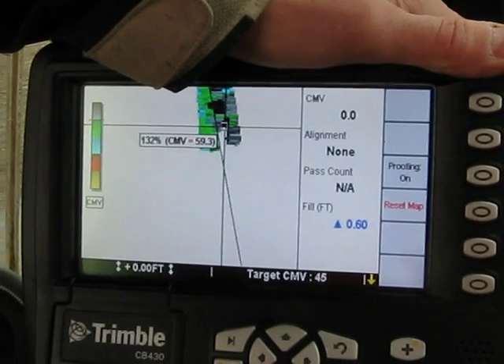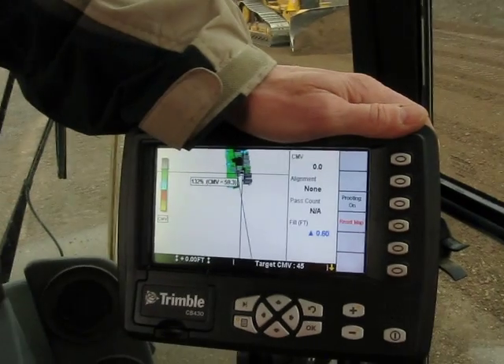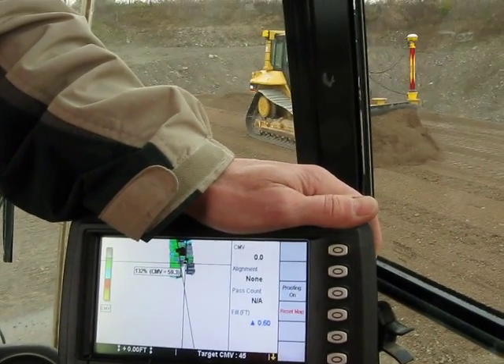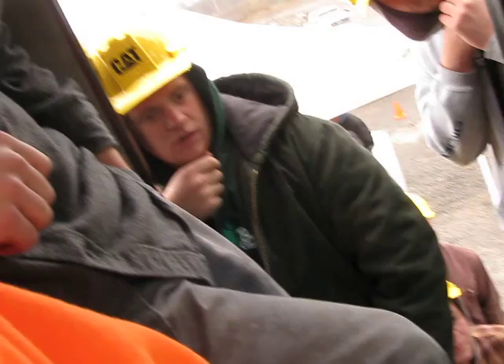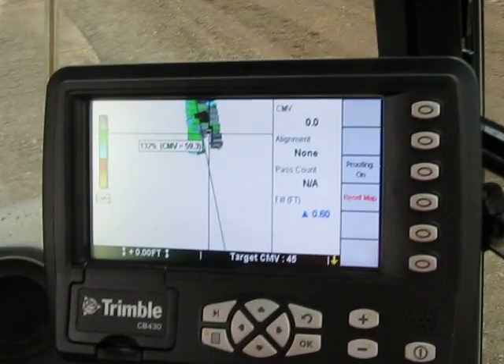That's what's coming — pound the rod, right. There are a couple more widely used methods, like the foreman who goes out and pounds the rod down to measure compaction. We're making his job a lot easier. He still wants to check maybe half a dozen points in a mile, but with this you're checking every square foot. If you've got a spring under there or an old rotten culvert you don't even know is there, it'll show up on here — it'll be a different color.